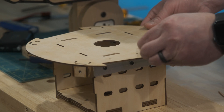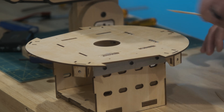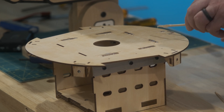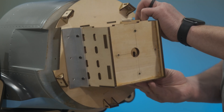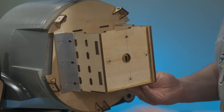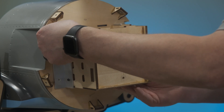Let's break out the epoxy. I'm starting to put epoxy on the tabs of the motor box — that's going to do two things: it's going to reinforce the motor box pieces, and then it's going to create a direct epoxy connection from the motor box to the front of the fuselage. I'm also going to do that to the cowl mounting tabs as well. Now we have epoxy on both sides. We are going to place the motor mount firewall up against the front of the fuse, use those bolts as pins to get everything lined up, tighten up the lock washers from inside the fuse, and let this sit overnight.